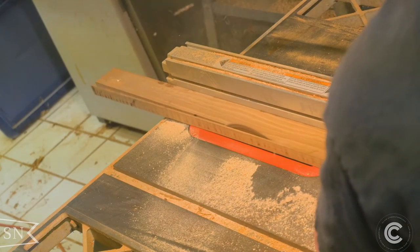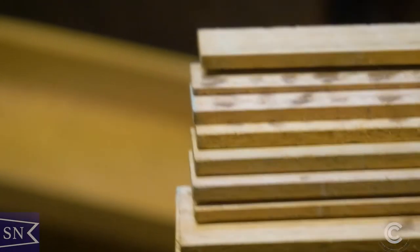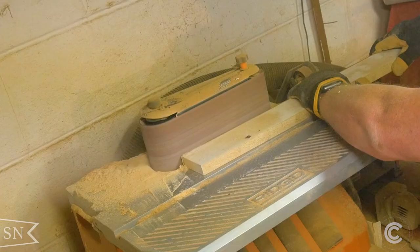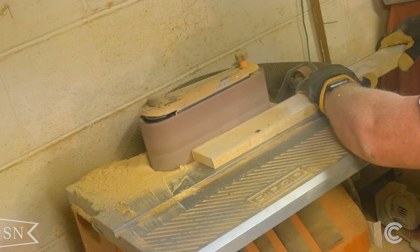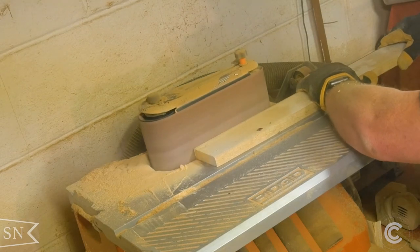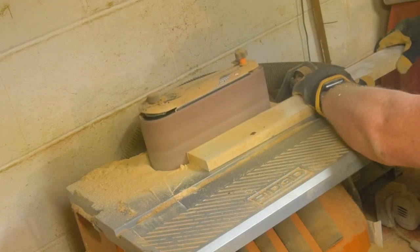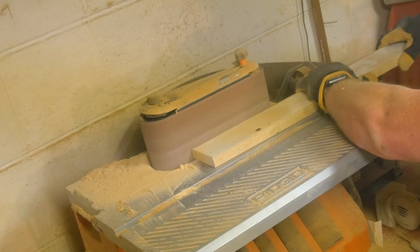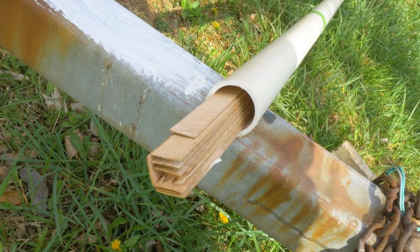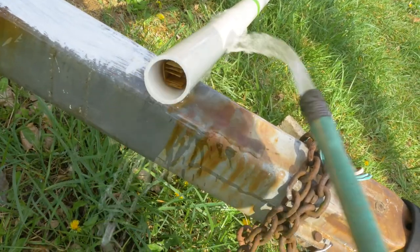I could make the strips much, much thinner — each of these strips was about two feet longer than the previous ones and less than a quarter of an inch thick. The next step was to put the taper on the end of each piece of wood by placing it against a scrap piece of wood and pushing it against the oscillating belt sander at a slight angle, giving me a perfect taper every single time without risking breaking the wood or getting my hands too close to the belt. The next step was to soak the wood — the heat transfer from the steam would be much more efficient if the wood was already saturated with water, so I just placed all the strips in a piece of pipe, filled it full of water, and let it sit for about an hour.